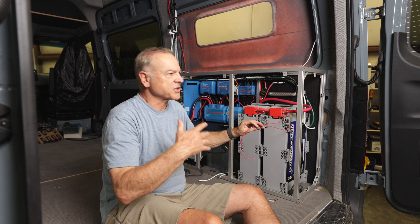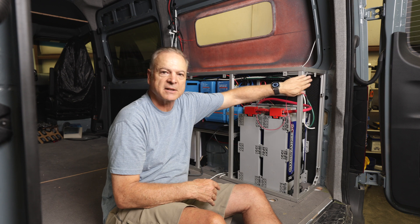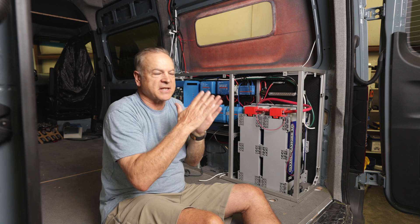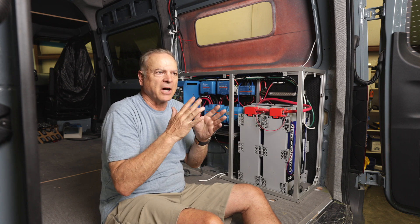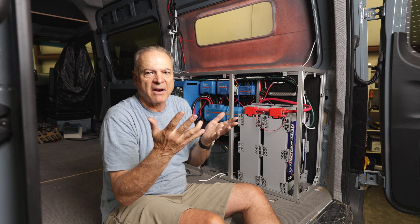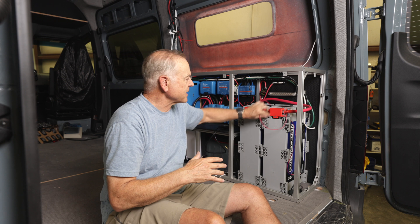The wires will go to a switch on the back of this electrical box to turn on the heated batteries, and they will just cycle on and off. There's a thermostat so that if it gets below about 25 or 30 degrees it'll kick on, and then when it gets up to around 40 degrees it'll shut off — so it just keeps the chill off of them.